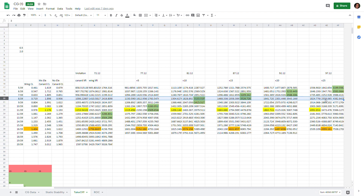It'll take even less than 25% elevator to initially bring the nose up because it's so light sitting on the main gear. But as it rotates and gets light on the main gear, weight transfers onto the wing and a lot more gets loaded onto the canard. Those two numbers confirm this works: enough lift on the main wing to get off the ground with an extra hundred pounds to spare, and definitely enough canard lift to raise and hold the nose up. We're targeting 85 knots - 97 miles per hour - and three degrees nose up.